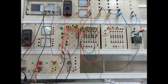So again, all that's happening is we're delaying the firing angle of the rectifier coming on, or the thyristors in the particular phase of this rectifier coming on. So if our crossover point was about here, we now have a bigger delay angle, and the thyristors aren't actually firing on until this point here. And then again, they follow the three-phase input, the particular phase that those rectifiers are on for.